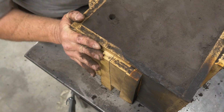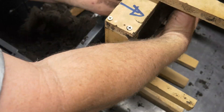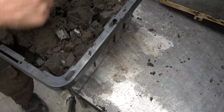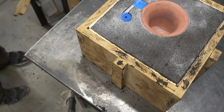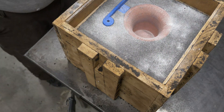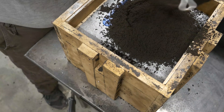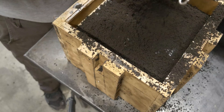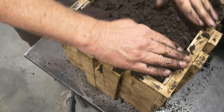I struggled getting this thing off - it's so heavy it's just stuck in there. I go ahead and pull the runner out and pull all the sand out of that false drag. Now I've got the cope full and everything's in place - there goes the runner back onto the plate in exactly the same orientation it was before. We're going to fill in the bottom side of the bell, pack that in there real well, get the drag struck off, and flip the whole thing over.